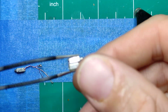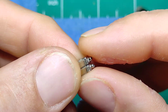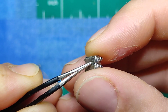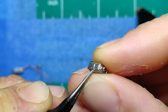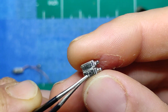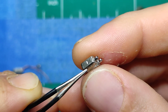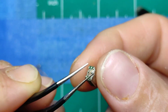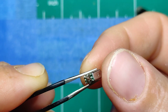So as for the BAs, they're pretty good. They're shielded, so you can see they're magnetically shielded, because if you put a DD too close to a BA, it can introduce magnetic flux into the BA. It's not too likely, and the effect isn't too much, but if you squeeze them close enough together, it can affect the performance of it.